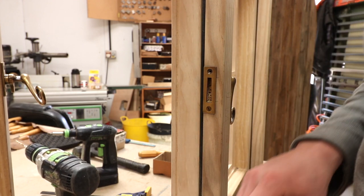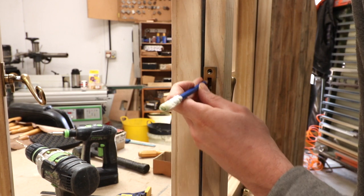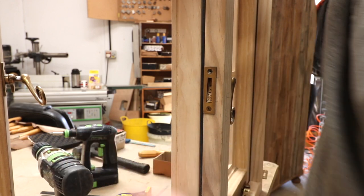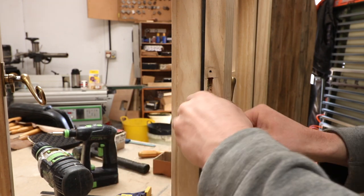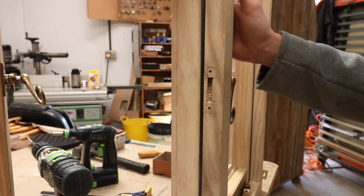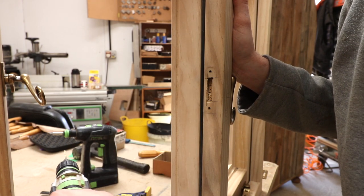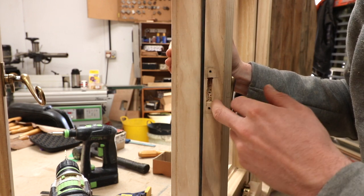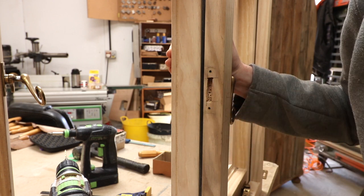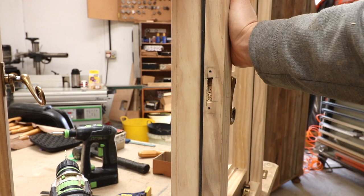Then we'll draw around the inside of that mortise latch plate for this hole here, take the screw back out, and we'll mortise the hole in the jamb of the window. The easiest way to do that is to use a small drill — generally just the pilot drill I've been using — and drill the four corners, then a slightly larger drill like a 6 or 7mm bit and drill three or four holes in a series within the lines you've drawn, then use a sharp chisel and chisel the rest of the opening out.